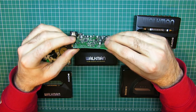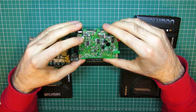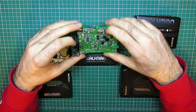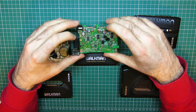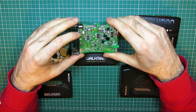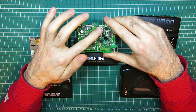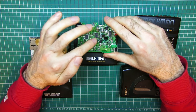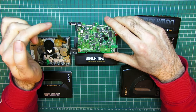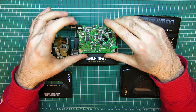This is on a very thin board, has to be very thin again for the clearance, so they have to be removed very carefully with hot air, not too hot, it has to be really carefully controlled, and then soldering new capacitors on is fraught with danger, because you can see very, very close to where the capacitors are, you've got plastic switches, other passive components, tiny proprietary chips, plastic pieces of sockets, battery clips and what have you.